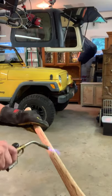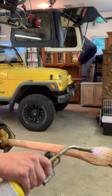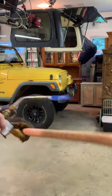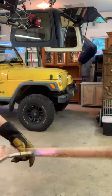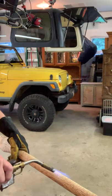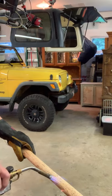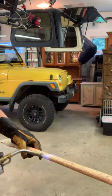I think I'm pretty much done here with this part. There's a little shade of color here and there — don't be afraid, you can always come back and sand it. I've had some where I've raised the grain so much that I had to sand almost all of the color from the burning off the handle in certain spots and then go back and touch it up. You can do that. Don't freak out, don't get all nervous — it's not the end of the world, it's just wood. Right now I'm adding a little bit of that ashy color to the large areas between the grain, just to give it a little more depth.